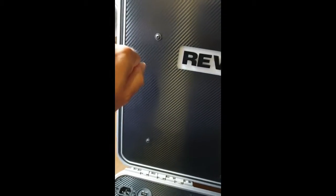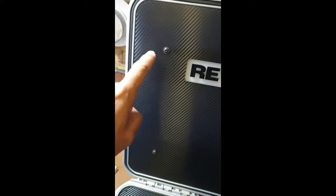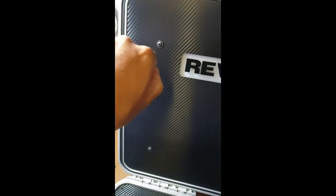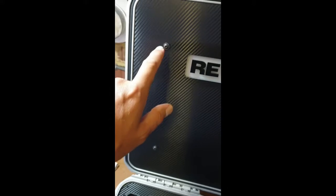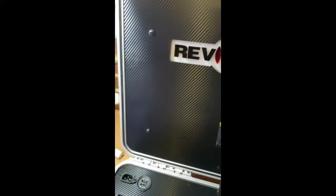I created a slightly bigger hole at the back end into which I could screw the M5 brass inserts I quite like putting into my decks, so that I can mount the supporting post with a small flat-bladed screwdriver through the M5 insert first. I can secure the standoff to the case, do that for the four corners, and then with the deck in place I can screw the M5 bolts, and you'll see they screw into the M5 insert. So that worked quite well. That'll probably make a bit more sense when you see the photographs at the end.